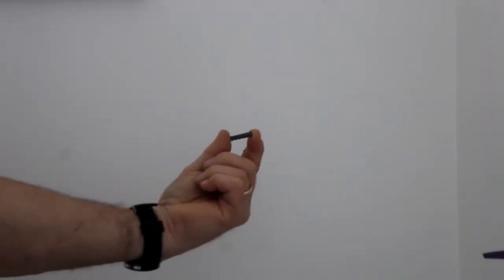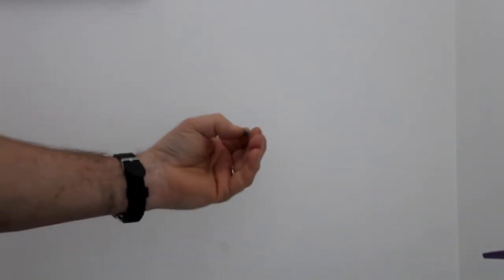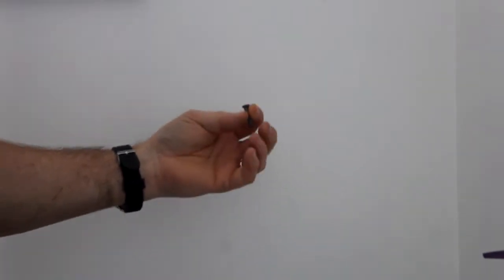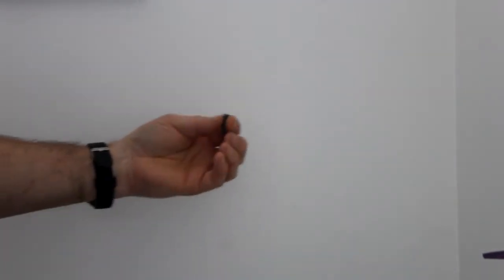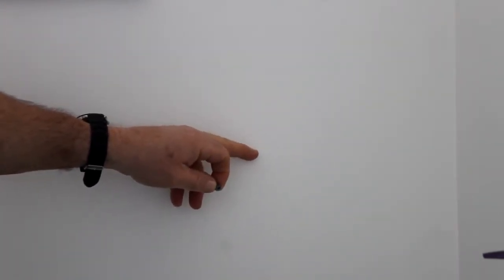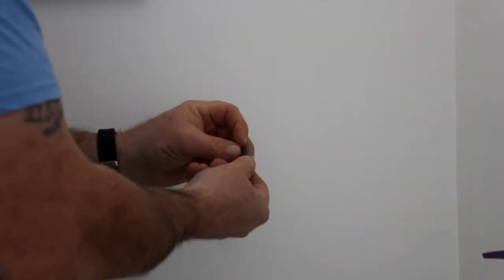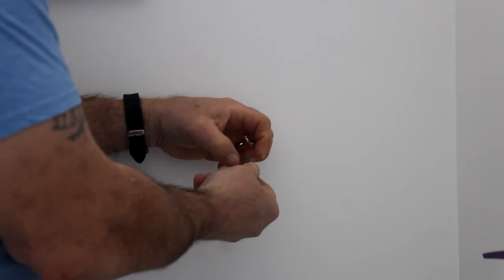What I have here is a little plastic wall anchor. And these little plastic wall anchors, these came with the paper towel holder. And this is for going into drywall. There's no stud behind here. So this has to be held firmly in the drywall itself. But drywall is not very strong. So the screws are not going to hold directly into the drywall. But when a screw goes into this wall anchor, the wall anchor has a split in it and it expands and it gets very, very tight inside the drywall. And that's what's going to help to hold it in place.